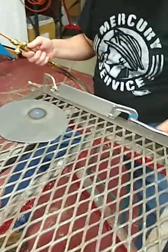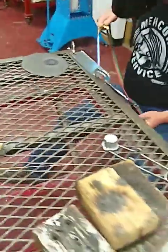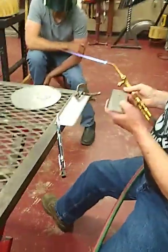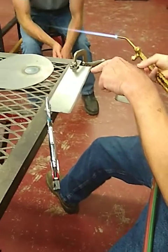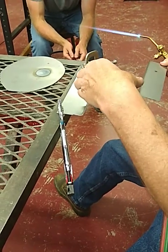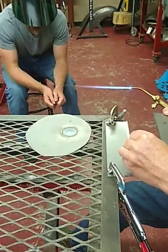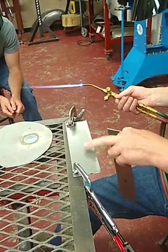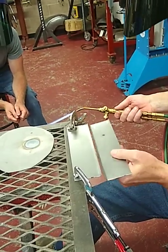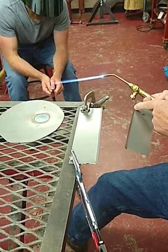I'm right-handed, so I typically put my right foot forward, my left leg up or comfortable, and then walk along. How fast can I tack? If the panel lines up and the fitment's good, tack right away. If it's not, let it rest — as the weld cools it'll shrink and these two bodies will come together. One is fixed, this is the operator — it may slightly go up or slightly down, so you just have to manipulate the steel back and forth and up and down to get the next section ready.